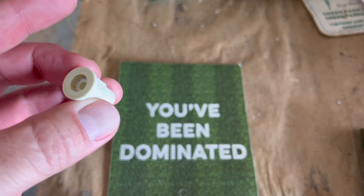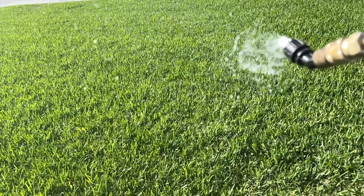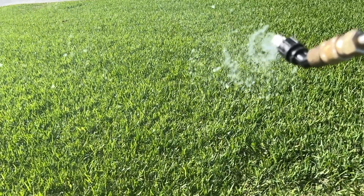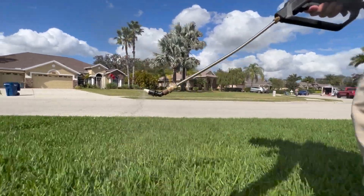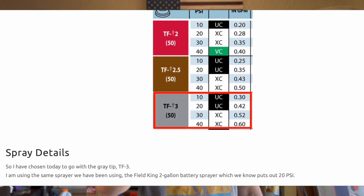In this training I'm going to be using the TeeJet turbo floodjet wide-angle flat fan tip, the TF-VP4. These tips deliver a flat spray pattern and come in several different sizes to regulate flow rate. This particular white tip allows enough liquid through to get an application done in just a few minutes, but it's not so fast that I have to run. I did a detailed blog post on all these different tips — flow rates, PSI, and how they work — and I'll put a link in the description below.